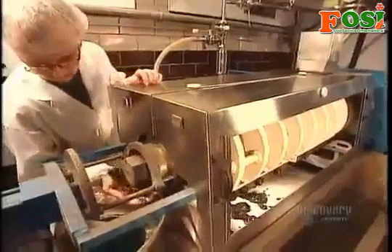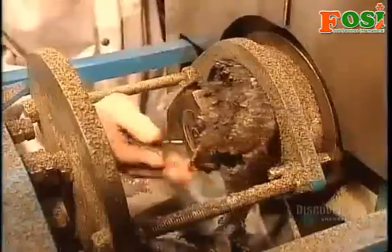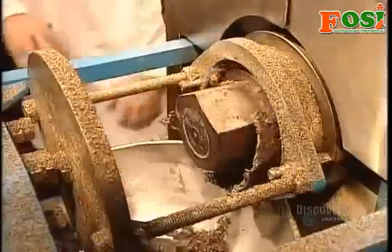The seed residue, called seed cakes, is later sold for animal feed. It's key to monitoring temperature — if the seed cakes are too warm, that means heat is building up, and they have to open the exit wider to reduce the inside pressure and bring the temperature down.